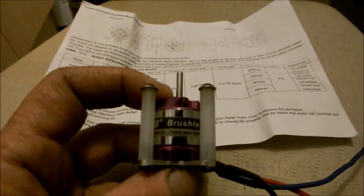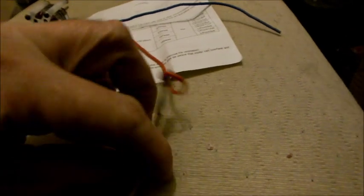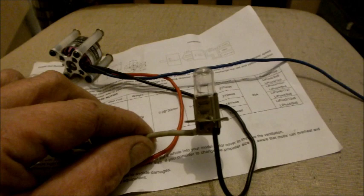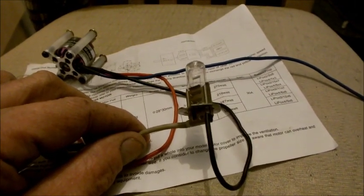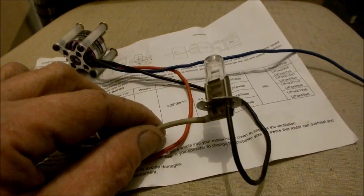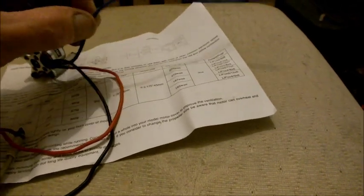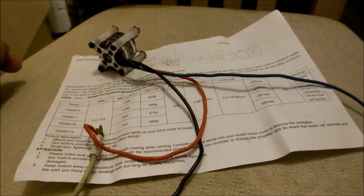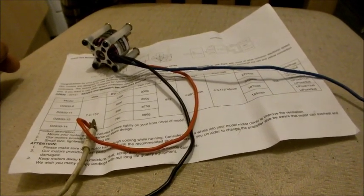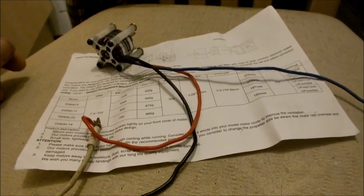In this experiment I have connected it to a standard 55-watt quartz halogen spotlight bulb. This is connected across only two windings — I've connected to the red and the black, leaving the blue unused. In later experiments I connected three of these lamps across all three windings, and the performance was exactly the same.